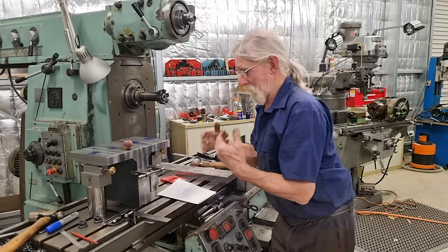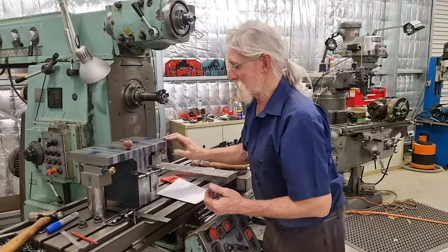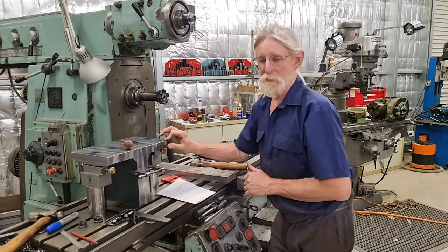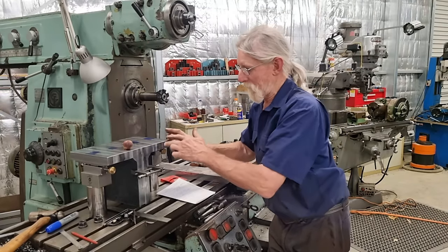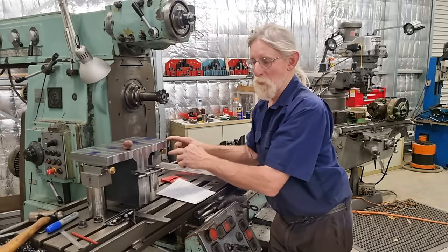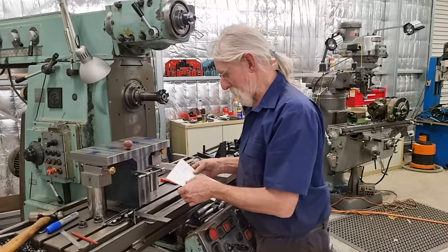Using additional engineering controls in place to eliminate problems is not always the first place to run to. So that's why it was all machine, no bracing. And then I knew when they were finished, after my finished cut, the faces were still square and there was no stress to be relieved after the braces were removed. So that's that one covered.